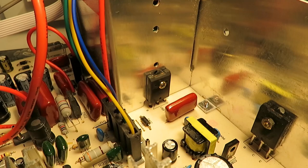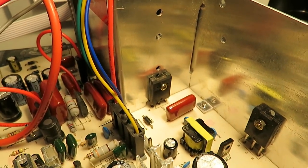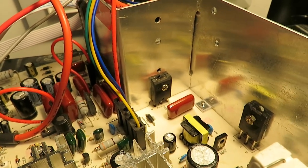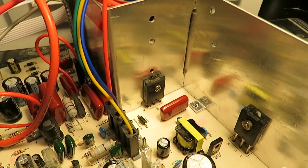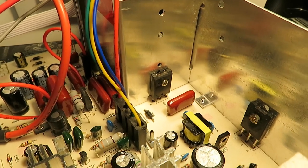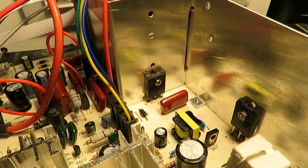As expected, I measured the resistance across the pins and I do suspect there's something wrong with that transistor. The output of this transistor goes through the windings of the flyback, so measuring the resistance isn't really conclusive — it may appear shorted unless you have a good multimeter with several digits of accuracy. But I can see it's shorted across pretty much all the pins, which is not normal.